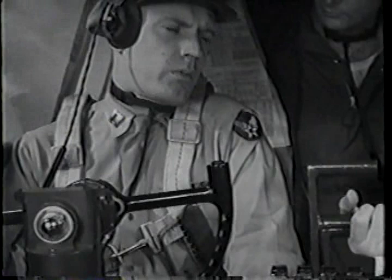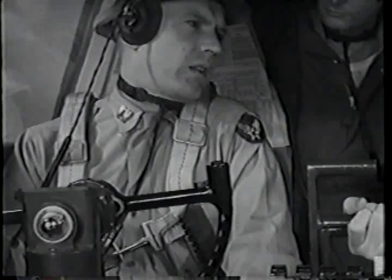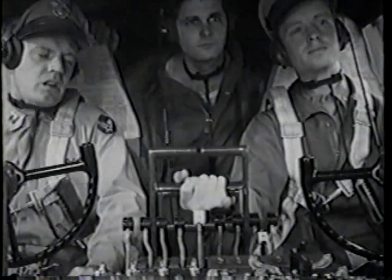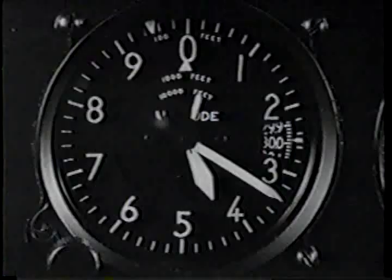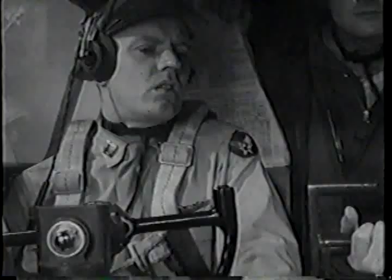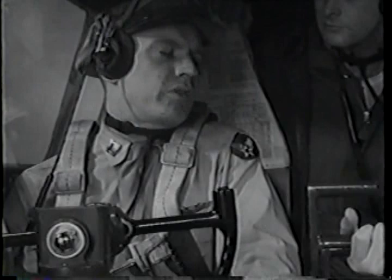Turbo and throttle settings always depend on altitude. For instance, if we'd taken off from a sea level field, we wouldn't need turbo or even full throttle for the early part of the climb. Another thing, always cut down manifold pressure before RPM. What's your altitude? We're nearly 1,000 feet above the field. Fuel boost pumps off? At 1,000 minimum. Check fuel pressure before and after.